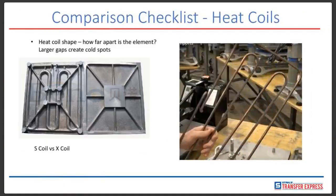Regarding the heating coil shape, you want to look at how far apart the heating element coils are. With the Hotronix brand it's an S-coil that goes back and forth. Some of the competition have literally just a big X through the element — what's called an X-coil. The Hotronix has cast-in tubular heating elements spaced out every two inches to eliminate cold spots. When you're not spacing the coils appropriately, you're getting cold spots on that heating element. Cold spots will result in a negative transfer situation where it won't properly adhere, and combined with pressure issues, that all makes for a bad customer experience.